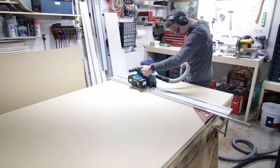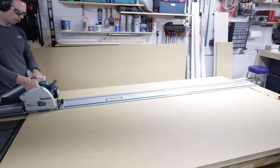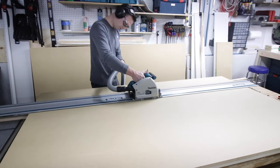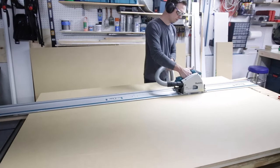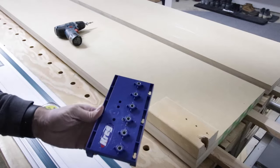Now it's time to cut the boxes. I'm cutting my three-quarter inch MDF to start the process for making the shelf unit boxes. Each side of the closet is gonna have a tall shelf system and a stacking hanger system for all the hanging clothes. The track saw makes cutting these long cuts awesome.